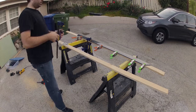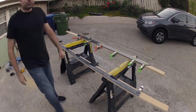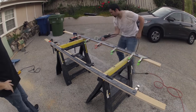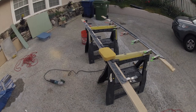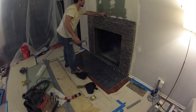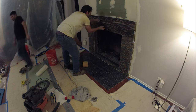At this point, the tedious process of bullnosing begins. If you have granite that you want bullnosed, you can bring it to professional shops that will charge you a bunch to bullnose it on high-tech machines, or you can do it yourself. We're approaching it with the DIY mentality. Neil has brought his grinder tool with a series of pads that start from a very coarse pad all the way down to a super fine one. He goes through six or eight of these different pads, starting with the most coarse, and bullnoses the edge of all the outer granite pieces so they'll have nice smooth rounded edges.